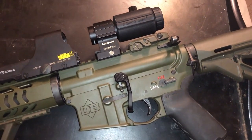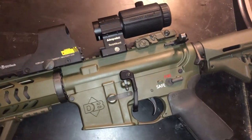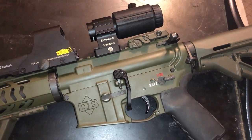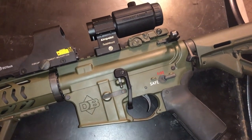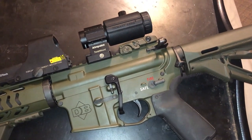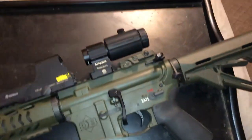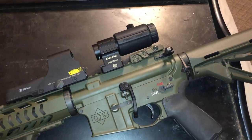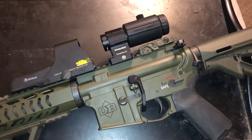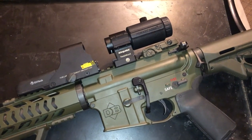And in a true life-or-death situation, you don't want things that require microscopic amounts of pressure to go off, because you're going to be excited and nervous and shaken. Not to mention when you start grinding or polishing or filing on these trigger mechanisms, you can change geometry and maybe make the gun unsafe. So this is the first thing that you should do. Honestly, this will fix 90% of your trigger problems.